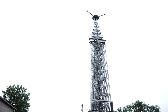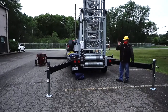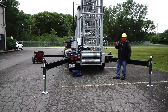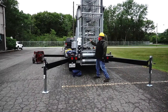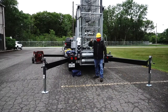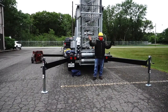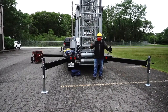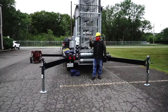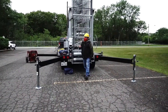And you have cables here too, and you have cables in all your sections here. We have the three cable pulling system. Why? Like I explained before, the cables have a lot of power to support all your sections. So when something happens with one cable, you have the other two. Like that, you have enough power to put it down, because I don't recommend leaving the tower there with only two cables. But you have enough power to put it down, replace, and back.